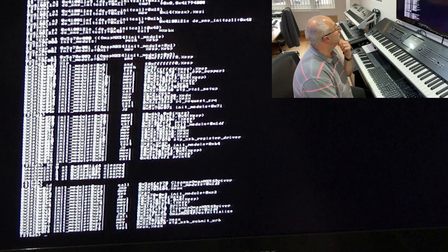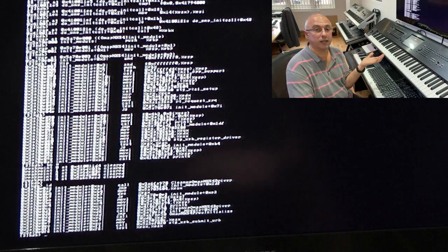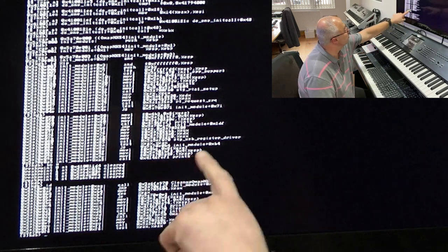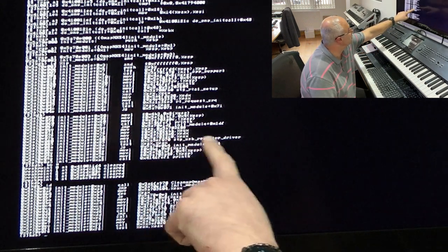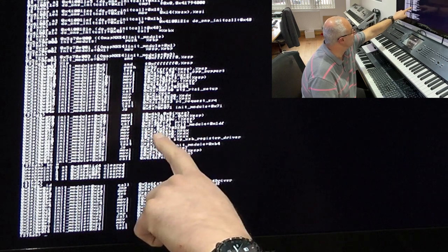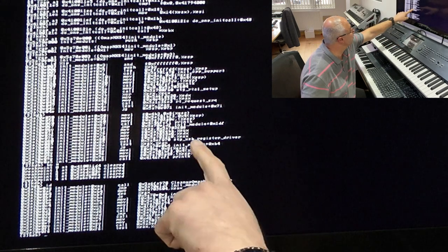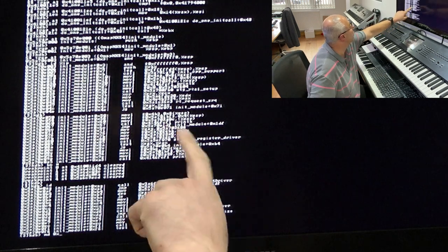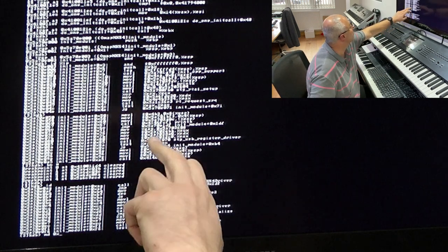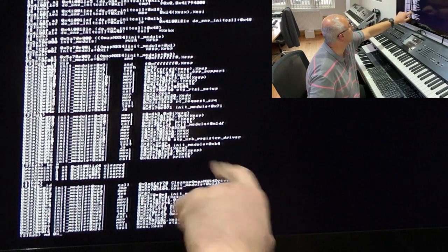So, this is how I can pick things up and look into them before they happen. For example, this print key in here is going to print something. And if I wanted to know what that does, I can just look into the line that's going to the stack, or the first of the stack pointer, which is, for example, this one. So if I dump the memory of, where is it? Let's pick this print K up here. Where is it gone? Print K.